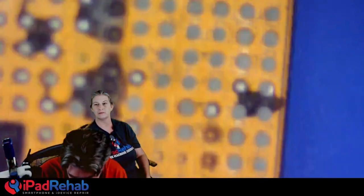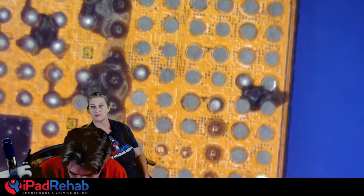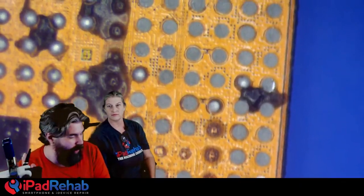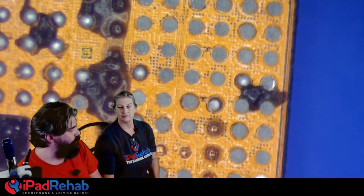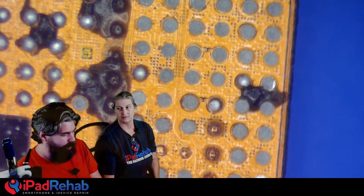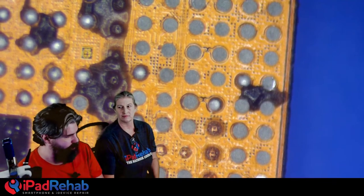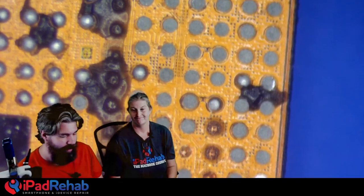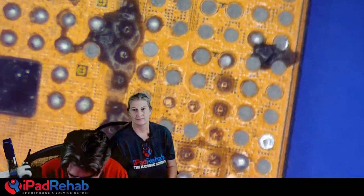Now, how do we get missing pads? Like, what's up with that? Does it come from cleaning it or what? It can come from, if the phone has already suffered an impact, they can already be really loosely connected, and then you take the CPU off and, typically at corners, there will be some where the pads just stay on. Okay. Or it could be from not using enough heat when you're taking it off. Or you could also do it from being too aggressive when you're wicking.